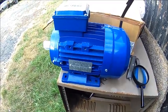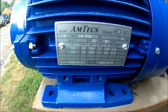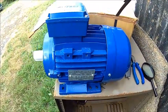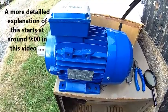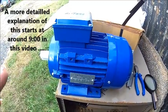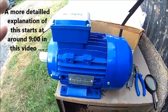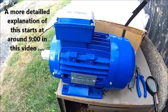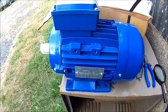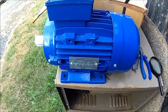Well, this is not exactly correct, because nowadays we have VFDs. It says 220/60 Hz or 380/60 Hz on the nameplate, but our mains here is 230 volts, 50 Hertz. So I tell the VFD this thing is 60 Hz at 220V, and run it at roughly 65 Hz at 230 volts — or the same with the 400 volt side — so it will run at about 1700 RPM with full torque. This is actually a good deal.